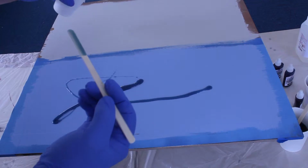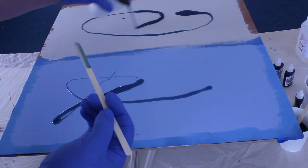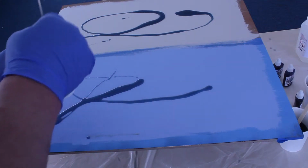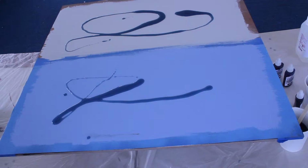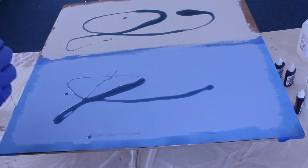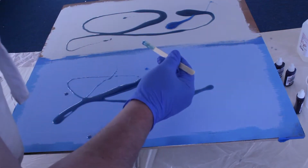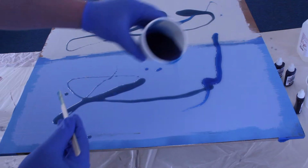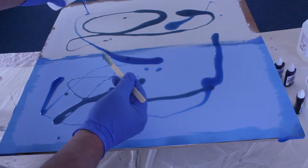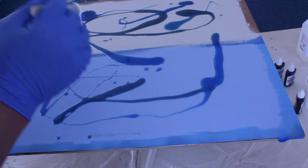Sample board has been prepped and cleaned off, checked with a spirit level, because as the board is tilted, that is the direction the material will go to, because epoxy resin is a self-leveling material. Please check out the video on how to mix 2-pack resin with colour, and the colours we're using are from that video.